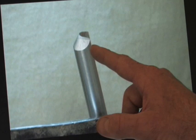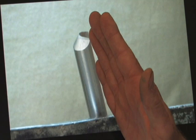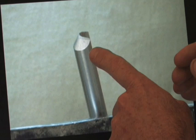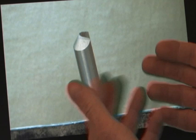Let's get on to our half inch bowl gouge that I call the bottom feeder. It has a traditional grind, as you can see on here. Basically, it has no fingernail. The edge here is almost 90 degrees to this surface. The beauty of this design here is it cuts wood cleaner. However, it's not as versatile as our fingernail grind, but you'd like to have a tool like this to cut really hard timbers that are hard to cut clean, maybe curly grain or burl or whatever. This will cut the job cleaner. Now let's look at this tool in action.